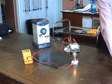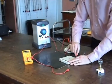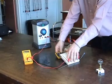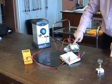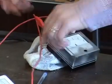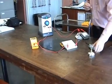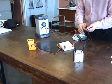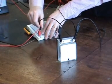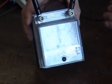Now let's finish off with measuring voltage. I've swapped the light bulb for a piece of resistor wire — it's a complete circuit. I have about 0.38 amps showing on the ammeter. To hook up a voltmeter, you can use analog or digital. The voltmeter is always arranged in parallel — it's like checking the height difference at two different points. I hook it in here, and I'm getting a reading of about 4.4 volts.